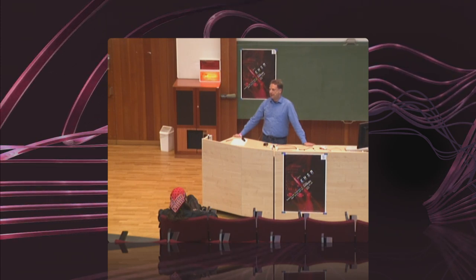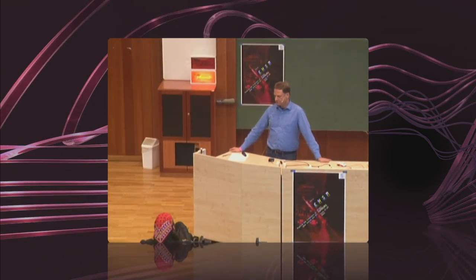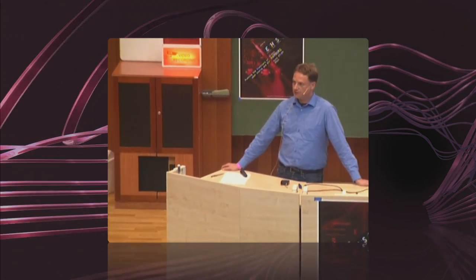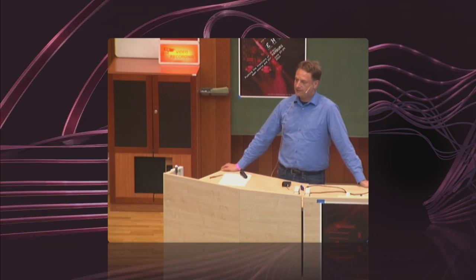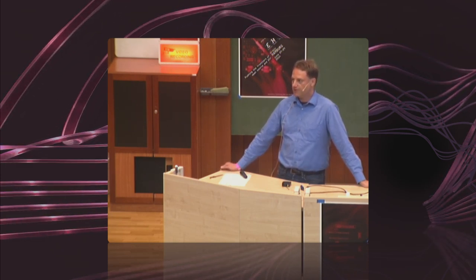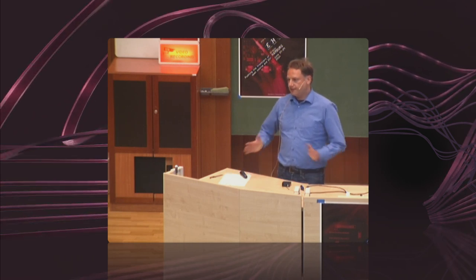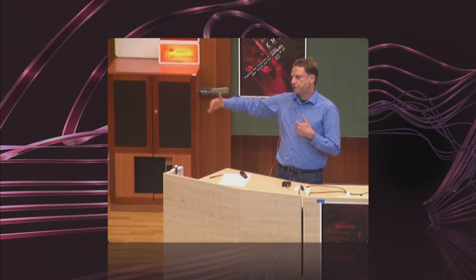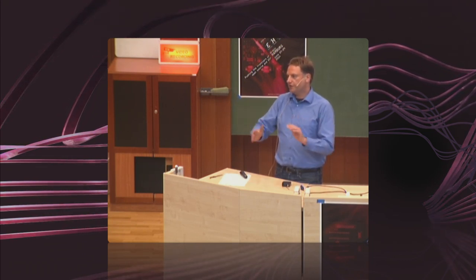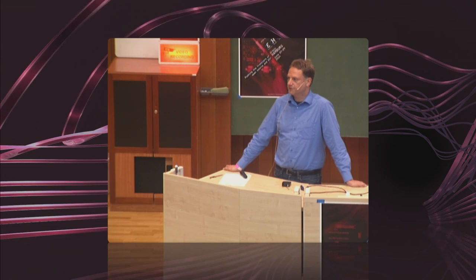Drift, you have in any interferometer usually, and the key component of the mechanical drift is the temperature. Because of temperature, you have extension of your parts, and you need to know that this plastic has larger extension coefficients than metal. So if the temperature in the laboratory changes as a function of time, and this is usually what happens from night to day, we have something like 23 in the day and in the night 18, then you have a shift, and you see as a function of time, if you measure for a weekend, that the fringe pattern moves out and then it moves together again. So there's something like a breathing of the fringe pattern. We have analyzed this in detail, but the key issue for us was to analyze this in comparison to the professional interferometer.